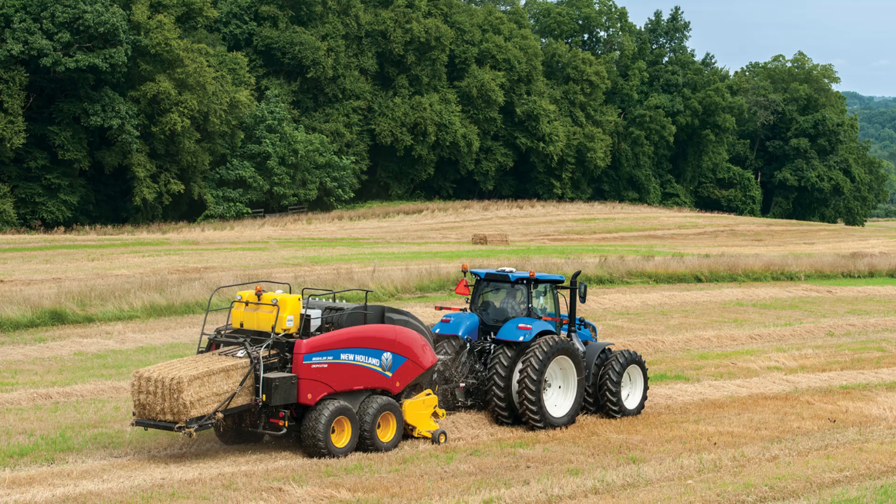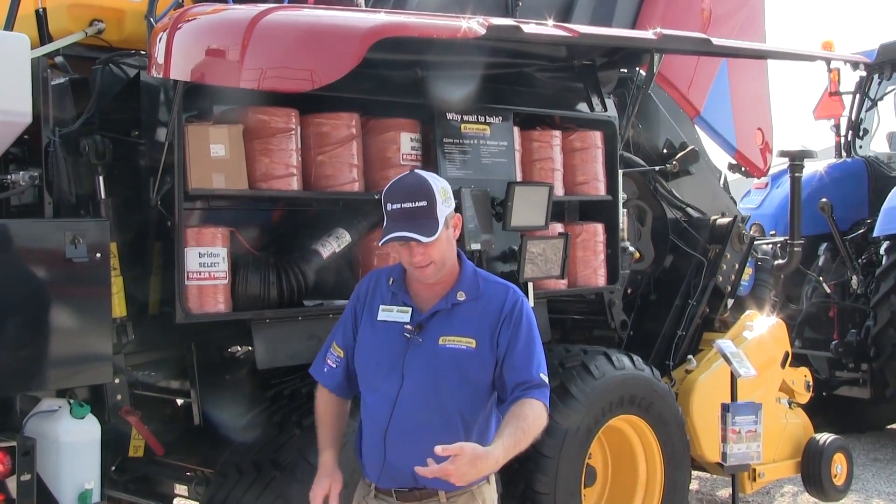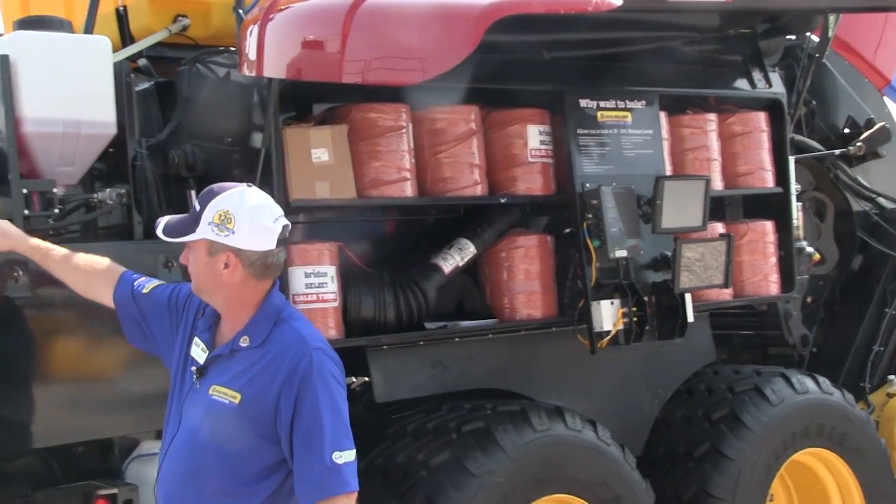The other feature on this baler, up on top in front of the tank, is called a tagger. It's an arm that comes down, lifts the outside string on the right-hand side of the bale, and folds a tag with a chip in it. A small white antenna flashes information to that tag, such as how much the bale weighed, the average moisture of the bale, and how many pounds of preservative were applied. If you have an antenna on the baler, like this one does, you can also input GPS drop point information — X, Y, and Z values — and then use that data to create a yield map.